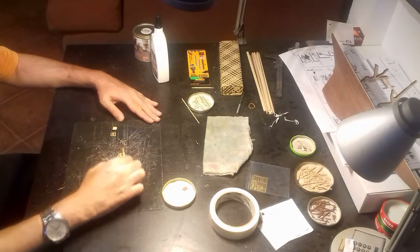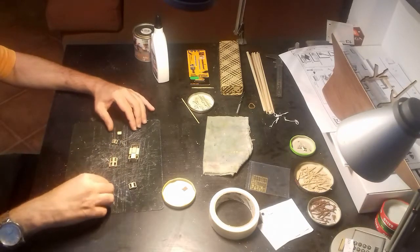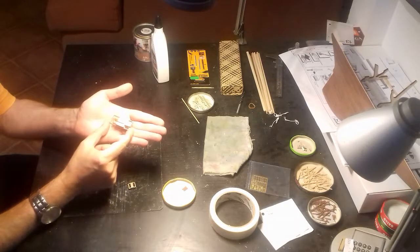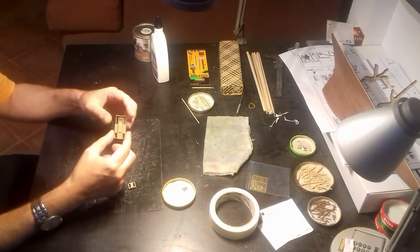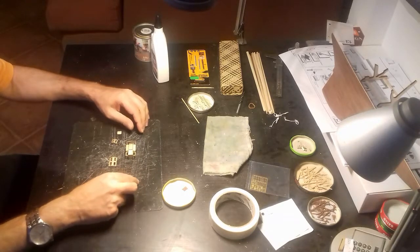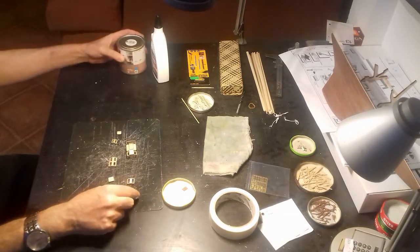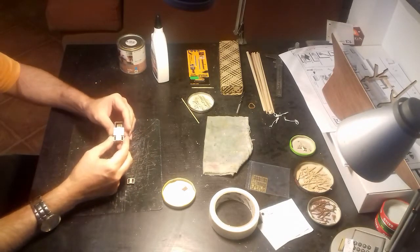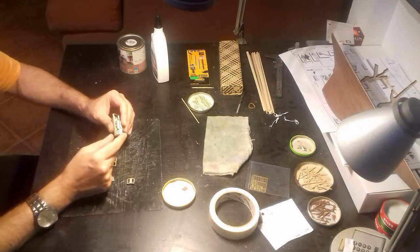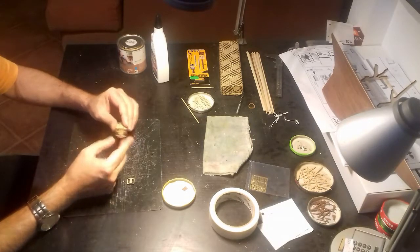The first part is now finished. I've built up the six structures of the deck furniture and assembled them. They are pretty fiddly because they're all pretty small — the main one barely the size of a finger — but they come out pretty okay. Now it's the step of adding a little bit of color to make them look like walnut. To do that I'm going to use some varnish and add a couple of coats, probably sanding between each coat to try and even out the color, and that way I can also eliminate some of the burn marks from the wood.